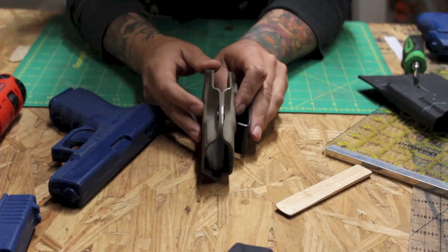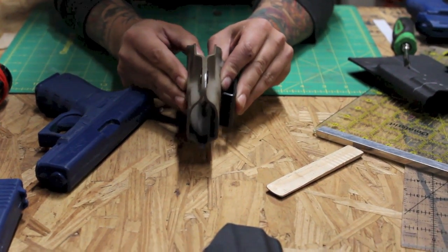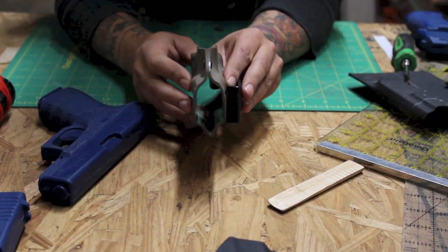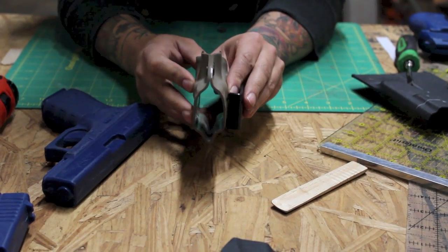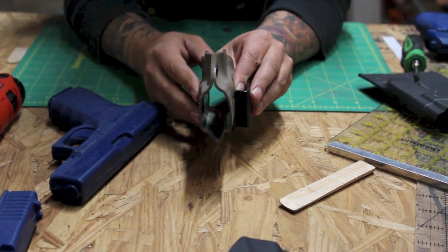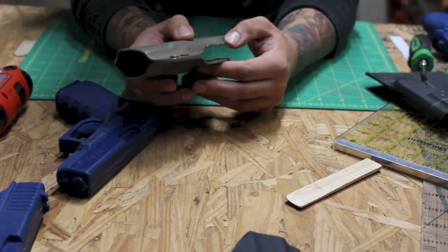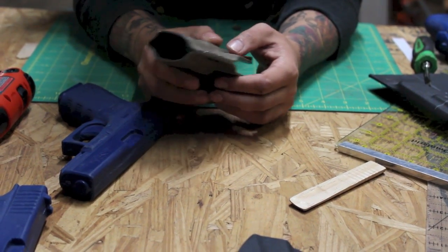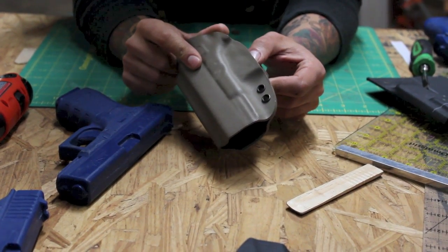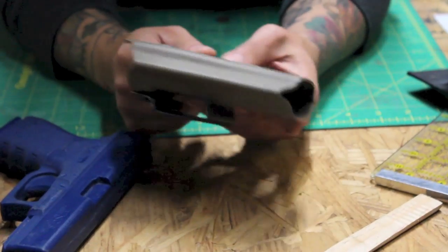Additionally, relying on this small dimple on the side — as the Kydex holster is subject to repeated flex in use — you might find that over a long period of time not only does that loosen up to a significant degree, but it's also harder to re-tighten or adjust back if a customer says it's become loose over time. Then you have to heat it up and rely on this for retention again. But if you have a trigger guard dimple, it's much easier to tune it back up either as the end user or as a customer service issue.